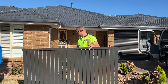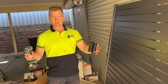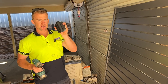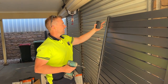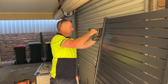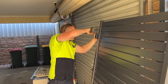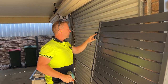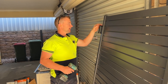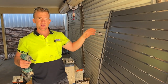We're going to hang the gate off this post. We've put the gate in the rough position to make sure all the gaps are right — do that before screwing anything on. We've got some heavy duty TrueClose hinges. I'm going to go two slats down from the top for one hinge, and two slats up from the bottom for the other, so it all looks uniform. Screw this side on first, remembering you've got screws coming through the side as well from the hinge leg.